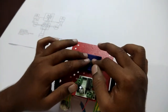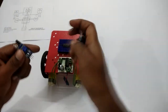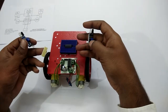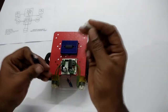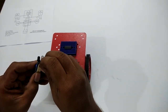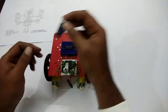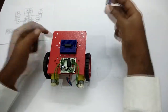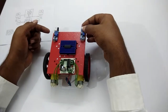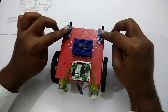After doing this, let's do the wire connections. For the obstacle avoiding robot, we're going to need two IR sensors. As I have shown you already how to connect the IR sensors, take the two-sided tape, stick it behind the IR sensor and peel off the paper. For the obstacle avoiding robot, place the IR sensor facing the two holes on each side, and make sure the IR sensor is straight.